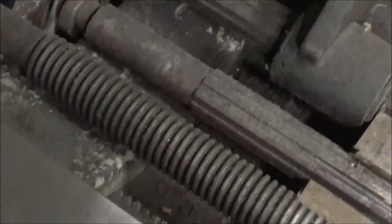So we're 0.5 towards the foot, 1 thou to the foot, 1 thou to the foot, 0.5 the other way, so there's a hump right here. 0.5 to the head, 0.5 to the head, 0, 0, 0.5 to the foot. This is the end where the tailstock should be. If I had the tailstock, maybe someday I'll find one to go on this mill that I don't have to trade a kidney for. Let's look at the other side.